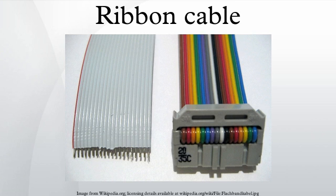However, portable electronic equipment usually uses flexible flat cables. The main point of ribbon cables is to allow mass termination to specially designed IDC connectors, in which the ribbon cable is forced onto a row of sharp forked contacts. Most commonly, termination is done at both ends of the cable, although sometimes only one end will be IDC terminated, with the other end being terminated in a regular crimp or solder bucket connection. Although it is sometimes possible to dismantle and reuse IDC connectors, they are not designed to allow this to be done easily.